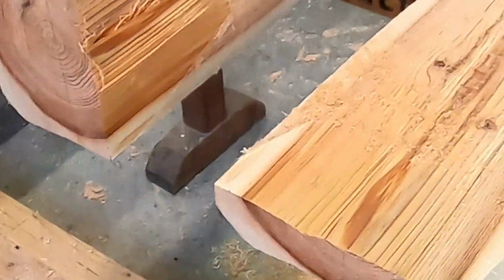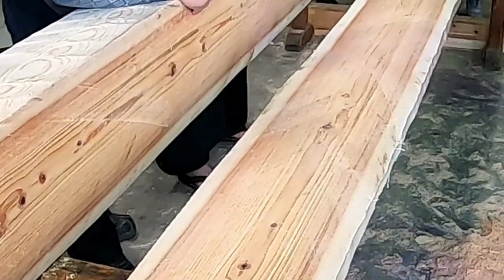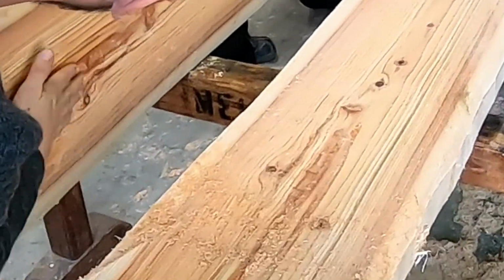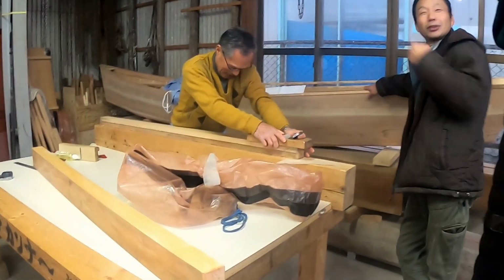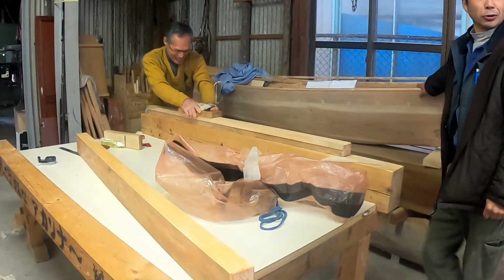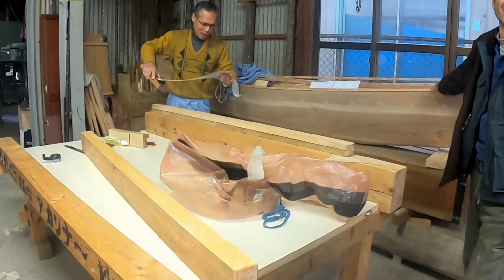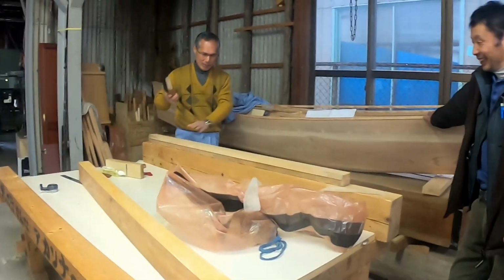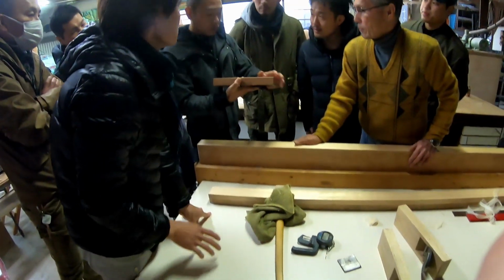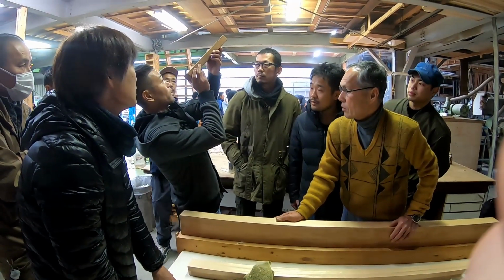Again, the sawn surface can be used just as is, because it has a very certain aesthetic to it, or finished planed. So speaking of that, the last process on display at the festival was finished planing with a Kanna, the wooden block pull plane that was developed in Japan from the Chinese equivalent that was brought over many years ago. So if hewing is like NASCAR, then hand planing is Formula One.